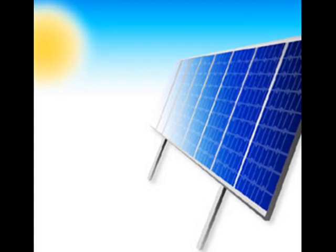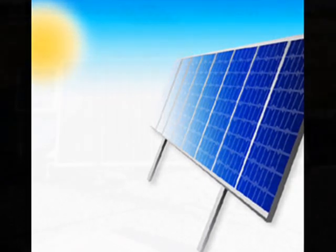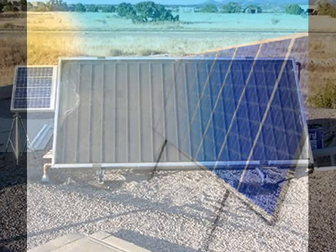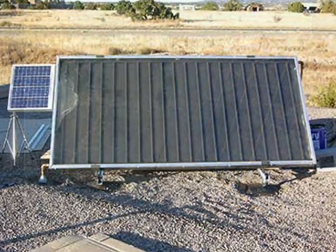The intermittent nature of sunlight can cause circulators to come on before a collector warms up. When the sun ducks behind a cloud for a minute, heat collection stops, even if the collector is hot. Open-loop systems using PV power alone are the worst.